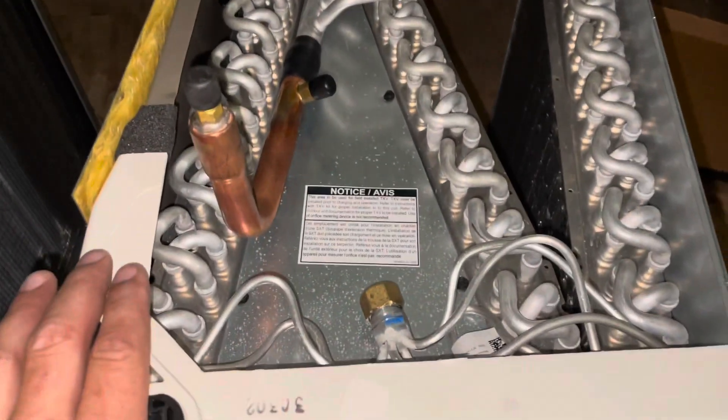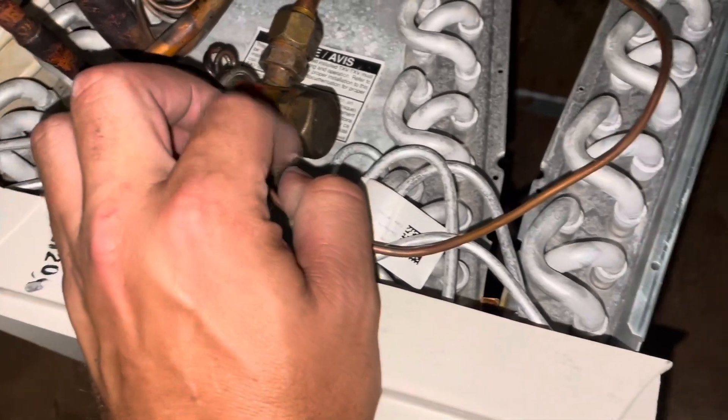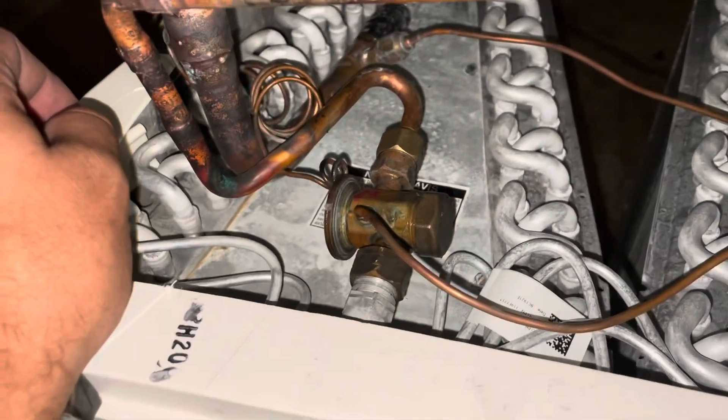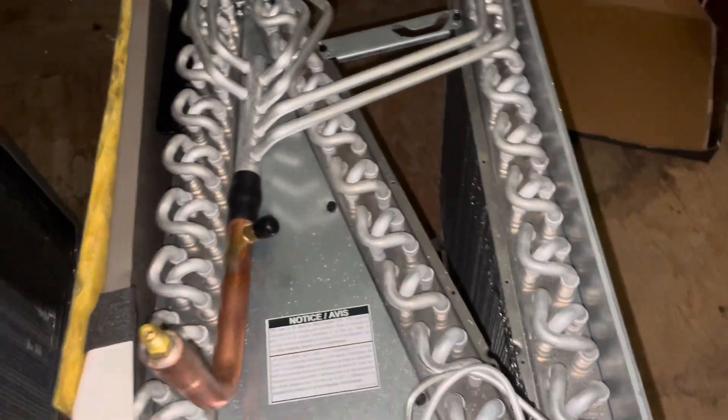All right, here is our new coil and here's our old. We got to take our TXV off here and pray to God nothing on there leaks, even though I see a lot of oil on this. I almost half want to see if our supplier has a TXV so I'm not putting this oily thing back in there. Looks like it might be leaking out of the base here. I just don't trust this TXV — it's got a bunch of oil on it. The supplier has one in stock, so we're just going to go get a new one.